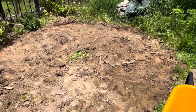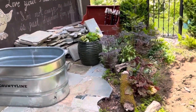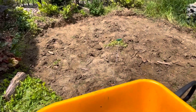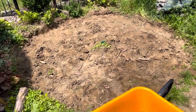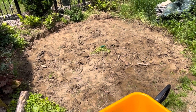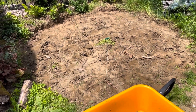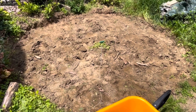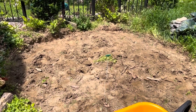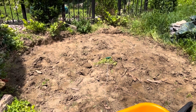I'm not level and this is the trick — my house is here and then it gradually goes downhill. I don't want water to pool into the house, so I'm going to have the patio not be entirely level. I'm going to rake this out and figure out how much I want it to go downhill with the actual patio. I think I'm going to have to bring out the leveler — I have a giant masonry one, it's pretty huge.